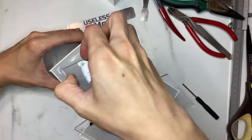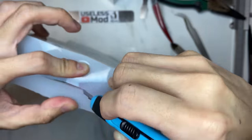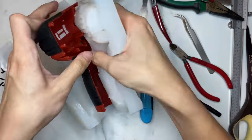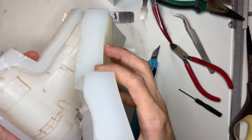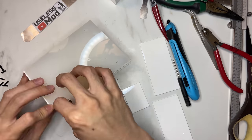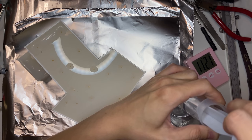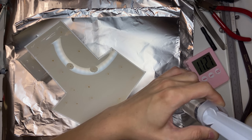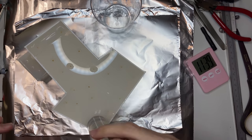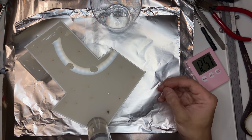After the silicone cured, take away the acrylic board and cut open the mold. Silicone inside the holes also needs to be cut away. Take out the original case and check if all the features are captured. Put the acrylic board back onto the mold. After mixing the A and B parts of the epoxy, start the epoxy pouring using a syringe. Remember to tilt the mold at an angle to eliminate gas bubbles. Insert the syringe into the lowest hole and inject the epoxy.